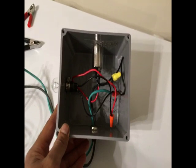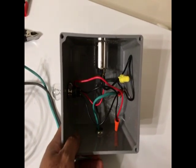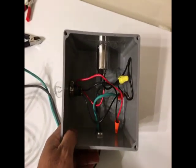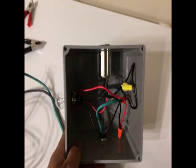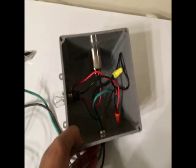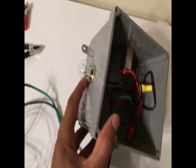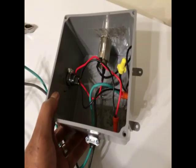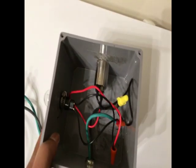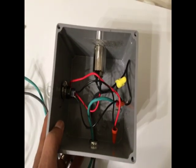Hello again YouTube, I'm back with another video. This comes from a suggestion by Phillip over at Solar Power Electricity and Electronics. He recommended that to charge capacitors — like for my boost box — you can use an incandescent light bulb from a car. You just tie it in with the power source and it will charge the capacitors slowly and more safely. I've tested the concept and it does work.